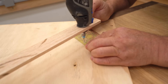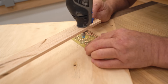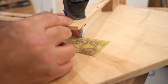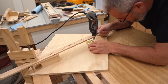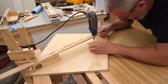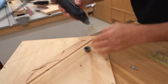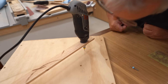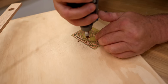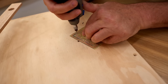I normally drill the holes with high-speed steel bits freehand, but I recently bought some solid carbide drill bits to try out. They really need to be held rigidly, otherwise they'll break. So I made a quick and dirty drill press — just a thin strip of wood with a hole drilled in one end for the Dremel to go through and clamp on, with the other end clamped down to a block to keep it at the right height. I found this worked really well for the smallest holes, but when I swapped to a bigger bit, it broke after just a few holes. There was too much movement, and also I drilled the smaller hole first — if I had started with the big bit, I don't think it would have broken at all. So I put in an unbroken bit and carried on the rest freehand.